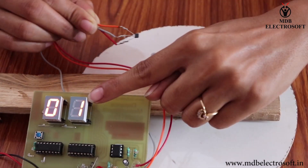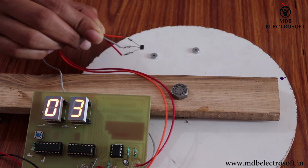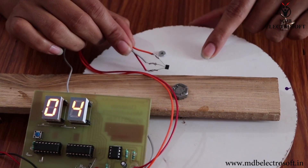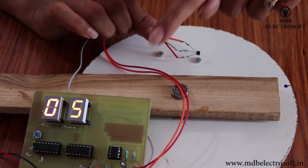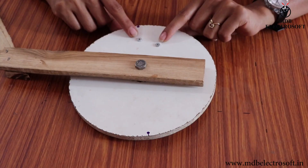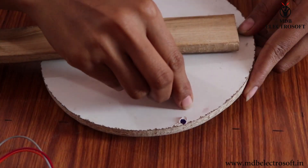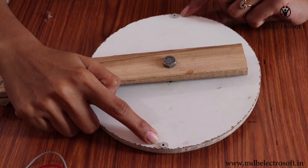When the sensor is brought close to the magnet, the counting on the display increases — that means we have to attach the magnet as it is now facing the sensor. When the sensor is brought close to the second magnet there is no change on the display, which means we need to change its pole. Turn the magnet — now the counting on the display is again increasing, so attach this magnet as well. The circumference of this wheel is 2 feet, so these two magnets are 1 foot apart from each other, and both magnets are now at equidistance.